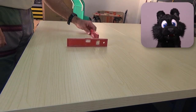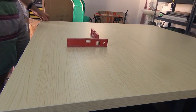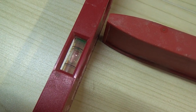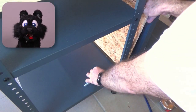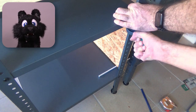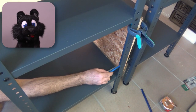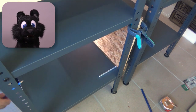Now that the two tables are where I want them, I will level them in both directions. And here's where the OSB comes in. I'm bolting the two tables together and adding one back panel between them. This will make the construction much sturdier. I thought about diagonal bracing, but this way I also have them covered up somewhat so that the chips don't fall in from the side.